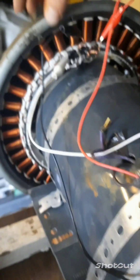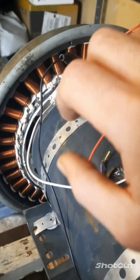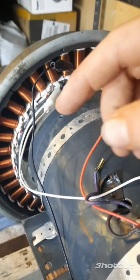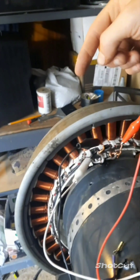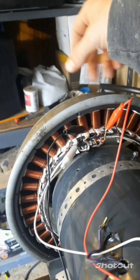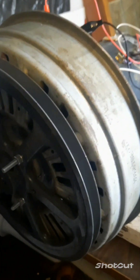Pretty affordable, pretty cheap. I'm not even a solder guy — I can sweat pipes — but I did drip solder on all those. It's the left side and the right side of the coil that stick out when you cut it. In the motor, it helps to mark it, and I cut them in the middle. Basically you got a coil between two wires: you take one wire and go this way, one wire and go that way. All the wires I turned to the outside I wrapped in series together — these three coils got grounded together, and these three coils got grounded together. You'll also see in the other videos when I do my ohms test — you have to sand the wires too, because these wires have a coating on them, and that got me.